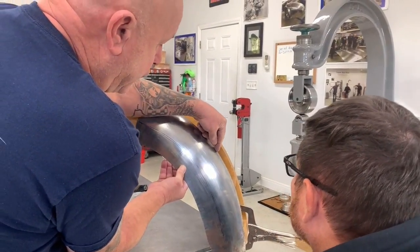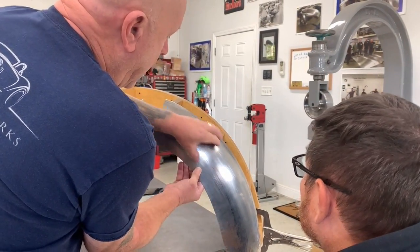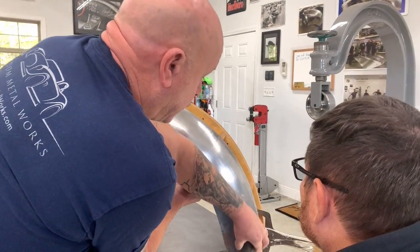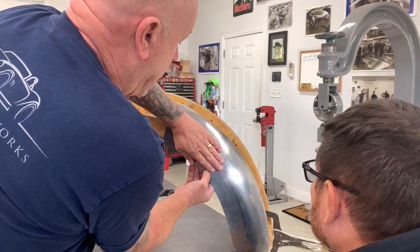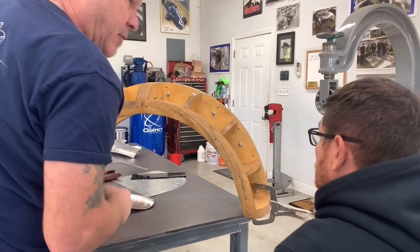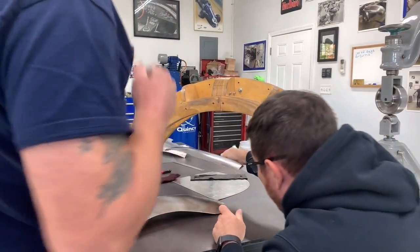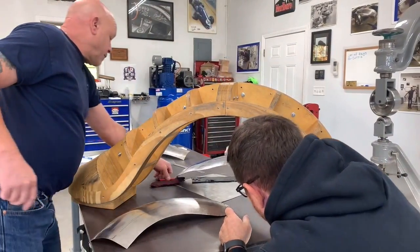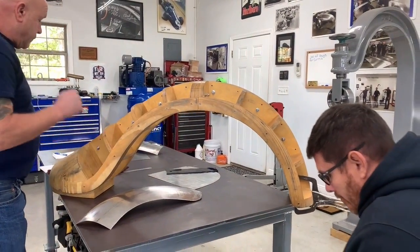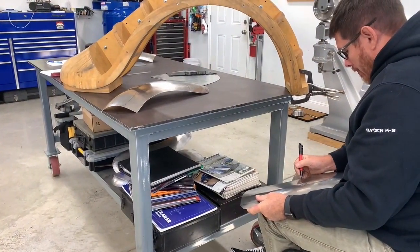Okay. So now you're going to run from here down to about here on your panel, and you're going to do a flat top that's a slightly higher crown, and you're going to punch some shape in around there to get your panel to have more shape through here and roll over. So now when you try yours up, get it in your mind's eye how much that's going to be, because you're going to dial in the pressure. And what we'll do is we'll pop onto the Mittler roller wheel.